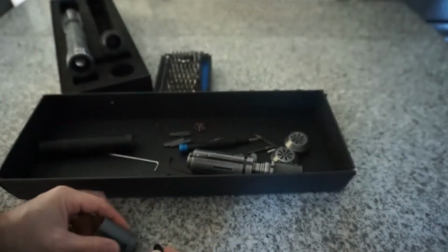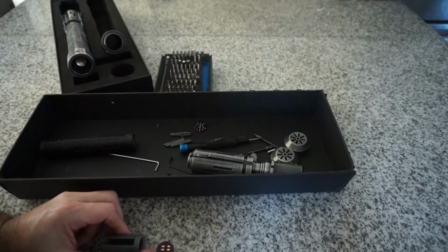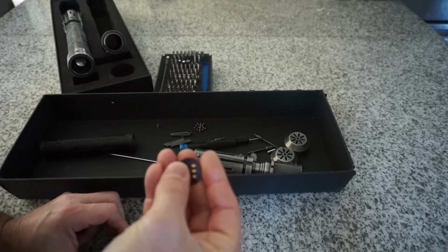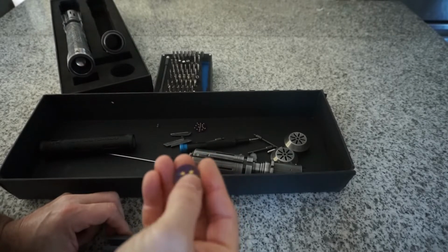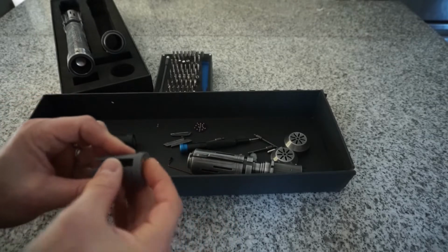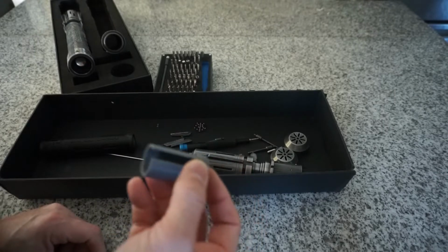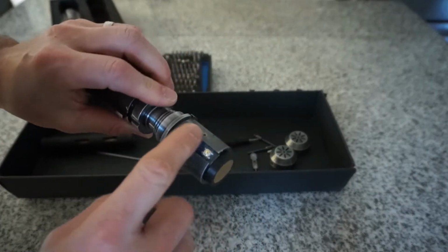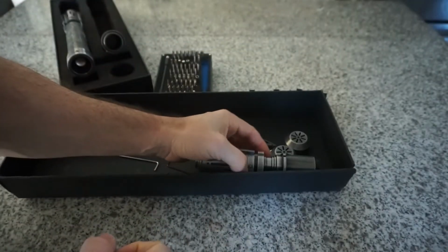And so, you know, I'm kind of working like this. I would do my button pads first. I'll do my pixel pads second. You can secure them if you want with a little bit of hot glue, just a little dab to keep the wires protected from being pulled out. But once this is locked in place, you won't really ever, unless you're going to do what I did and unscrew it and pull it out. There's really not much tension on that soldering joint.